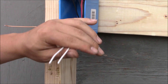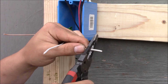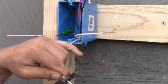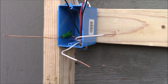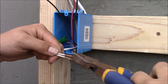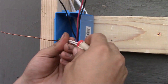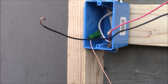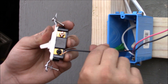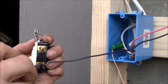Now we're going to take these ground wires and splice them together with the twist-on green wire nut. Next, we're going to connect together the neutrals. The neutrals are not used in the three-way switches, but it has been code since 2011 that all switch boxes need to be provided with neutral wires. We'll splice them together and use a wire nut. This black wire from the power cable is called the line wire, and it goes to the black common terminal.